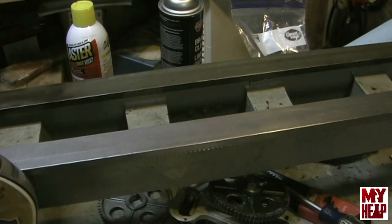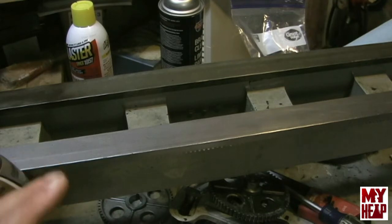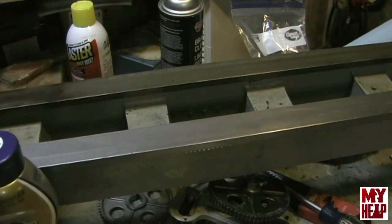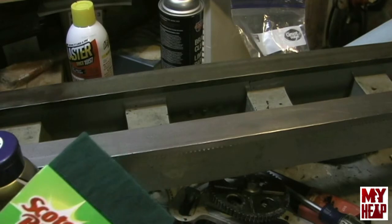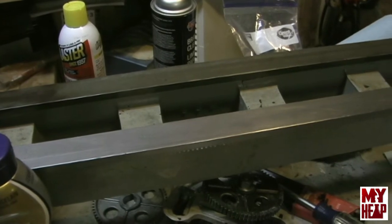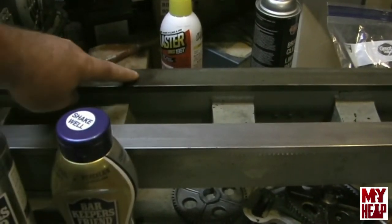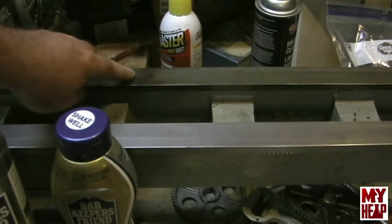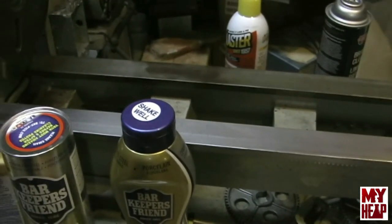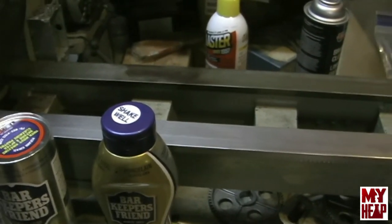I use the liquid stuff because I thought it would be a little easier to use. First I degreased the rails using some brake cleaner. Got all the grease off, then put some Barkeeper's Friend on there and used a green Scotch-Brite pad and scrubbed it real good. It took the stains and all the dark gunk off. As an example, you see back here there's a real dark stain. When I do the next video where I've got that one cleaned up, we'll see how big the difference is. But I wanted you guys to see the difference between the front and back.